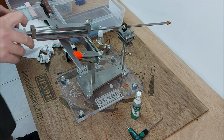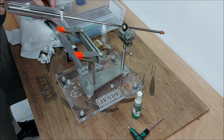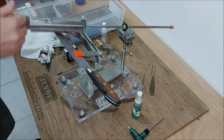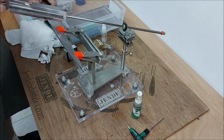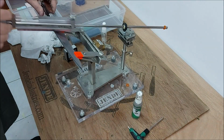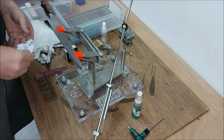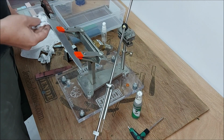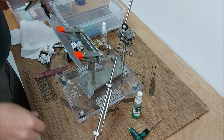Okay, back at 17, it's 3K. Now I'll hit the quarter micron again. Again, 3K is really good. I like to just tweak that with the quarter micron Jende Emulsion and Nanocloth, just to really take it to the next level.